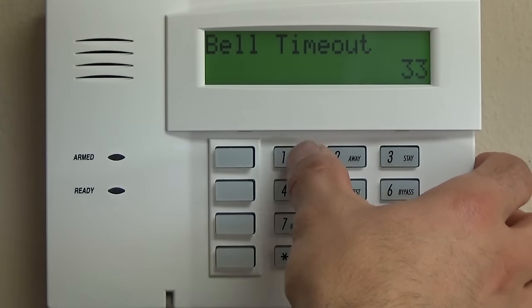And then the B button is going to be 99, police. So this C button here, since 96 is not activated, we're going to change that to display time. And then we'll do the same thing for button D, 02, star. So now what we have is fire, police, time and date, time and date. Again, this is one way to do it. This isn't the only way. This is something that works for us to keep it simple.